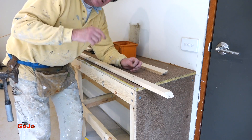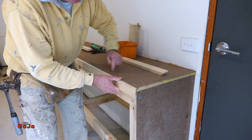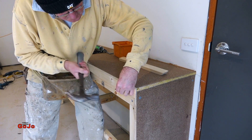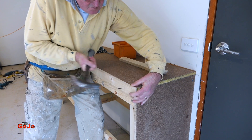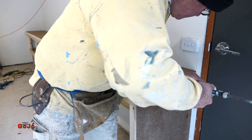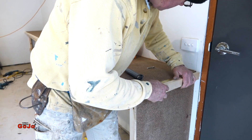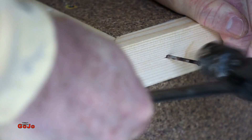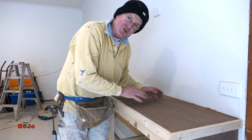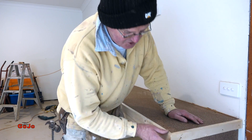Now for the finishing-off bits I talked about earlier — it's just this pine, 42x19mm. I put glue all on there, and you're going to get to see me use a hammer and nail. Look at that. Well there you go everybody — you can see a nice solid shelf. All sealed around the back edge too, by the way. So if any moisture gets into it it's not going to affect any of the timber or this treated chipboard. Finished off edges, all done.